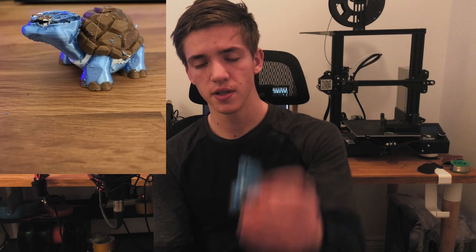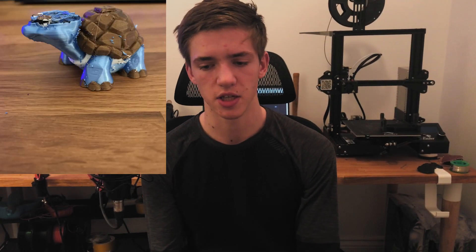We'll go over quite a few things. First off, we have had our first really successful result — this little turtle that we had already attempted in the past. Five days ago it failed when the MMU attempted to load in the black filament, because the black filament had never been used in the entire print, so it was not primed and the tip was really badly shaped.